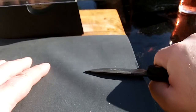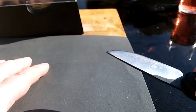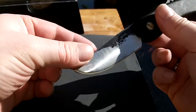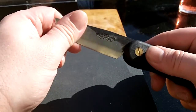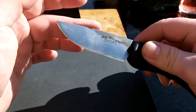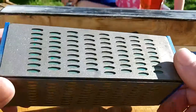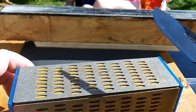When using paper, draw back towards yourself — don't go forward into the paper or you'll cut it. You need to raise the handle as you come back, keeping the angle of abrasion at 90 degrees to the very edge. Turn and lift to match whatever angle is on the knife. For a straight sheep's foot blade, just put it down and draw straight back. But if you have a curve or recurve, you really need to move the handle around to match those angles. The same technique works with cheap diamond plates from Aldi or Lidl — set your angle, work up through the grits.